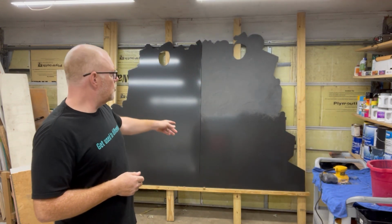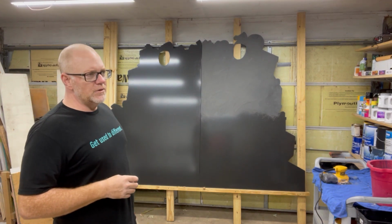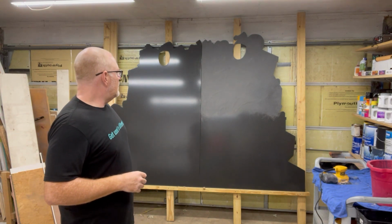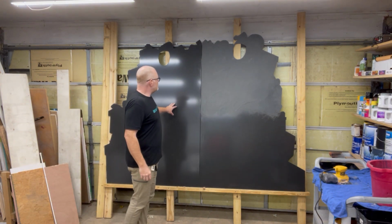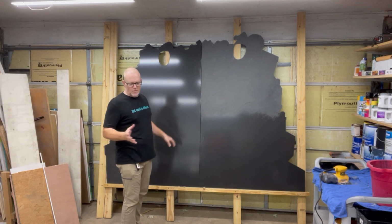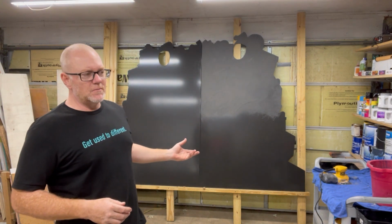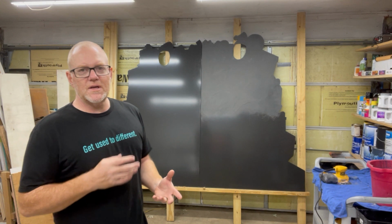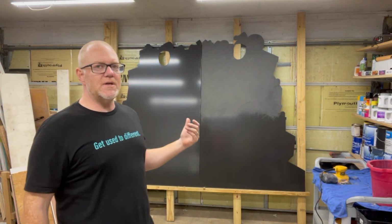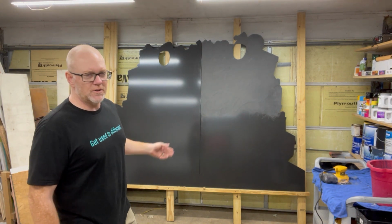Now the powder coaters put this bronze finish on here, and it's pretty thick. In mils, I would say it's a couple mils thick. And the next step, I've already started here. So this is super glossy. It's been baked on. Powder coat, in case you don't know, is a powder they spray onto the metal after they sandblast the metal. They spray the powder on there, then they put it in a kiln or an oven that bakes that onto the metal. So it's actually a better finish than painting it. It's the strongest finish you can get, really.